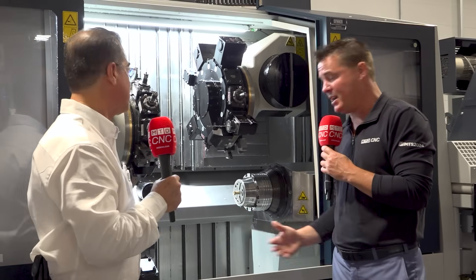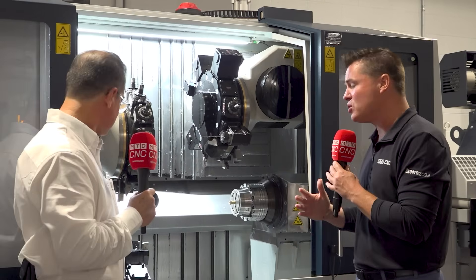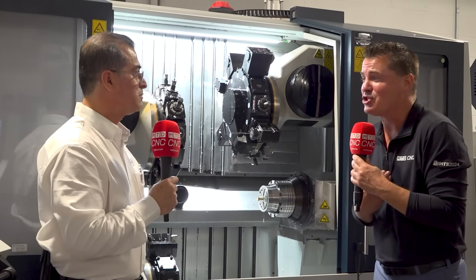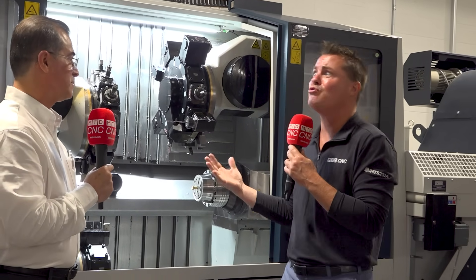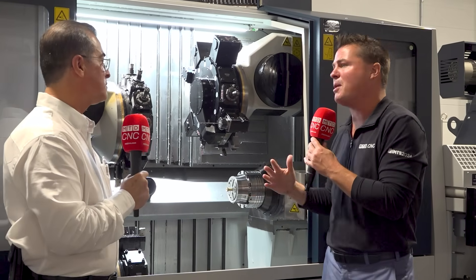You mentioned the width of the chip conveyor belt — I know how chips can build up and cause issues, especially with stringy parts. Let's quickly talk about the wider conveyor bed and what that helps with. It helps get the chips out — even when you get the stringy ones, the bird's nests as we call them. I always put myself in the shoes of the operator. I've done this since 1990, starting from the bottom as an operator, and chip buildup was one of the issues. When I'm thinking through an application, I look at the problems customers can run into. This machine's chip conveyor — at two feet wide — can get all those big bird's nests out of there a lot easier than a narrow chip conveyor.